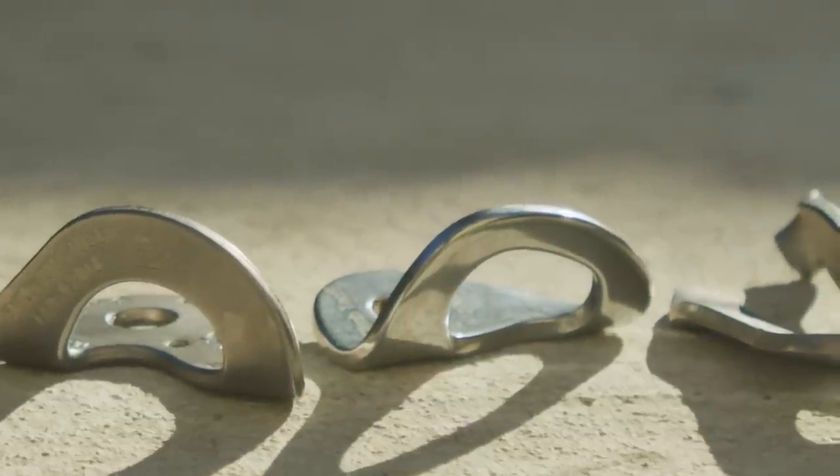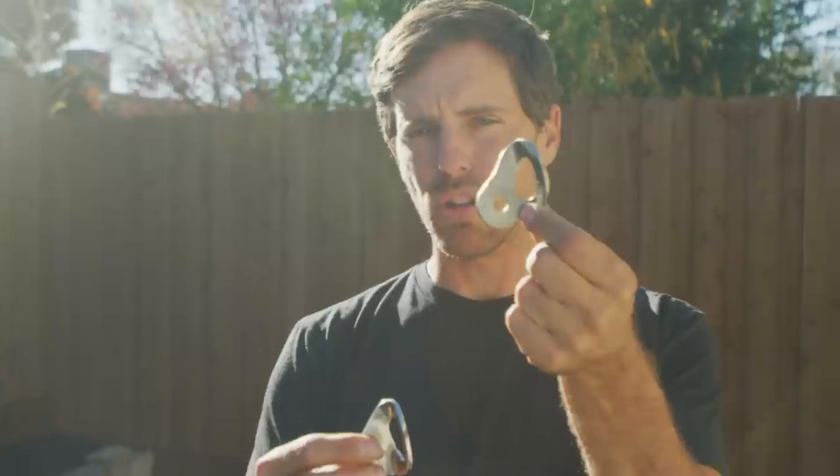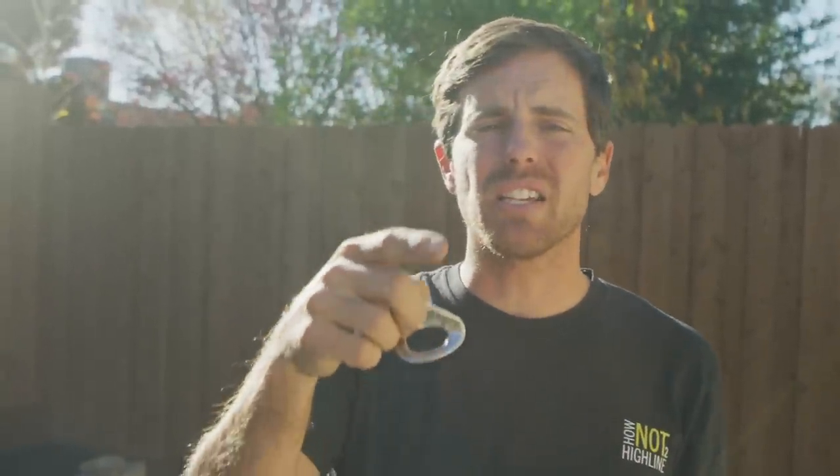Hi, I'm Ryan Jinks, and welcome to a Bolt Buster episode where we're going to talk about the 400 stainless steel series climbing hanger from Climtech. Now, this actually doesn't look like a stainless steel hanger, because if you compare these two, this is a much duller hanger. This is a fixed hanger that's 316L, and they have 304 stainless. Most places have 304 or 316 stainless. 316 is more corrosion resistant than 304, by the way. But 400 is actually less corrosion resistant than 304.